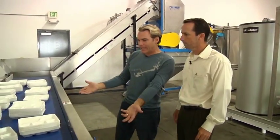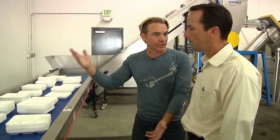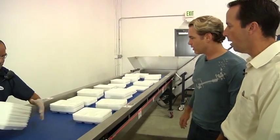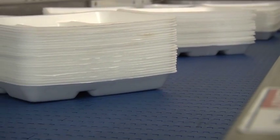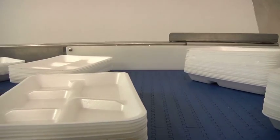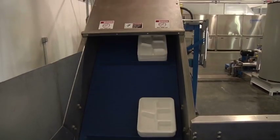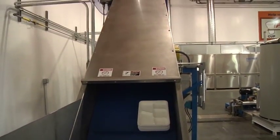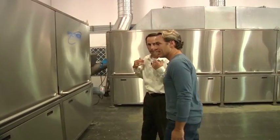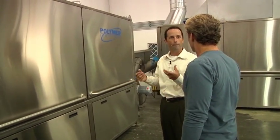So these trays — I'm looking at them, they actually look pretty clean, a lot like the ones up in Northern California. When you bang them on the trash can, most of the stuff will come off. These trays are being fed into the grinder right over here, so they're immediately going to be ground up. We haven't done anything to them at this point. We're going to grind them up into smaller pieces — that way they come unnested. It's just fluff, and then it goes into the washing unit. This is where they go from dirty trays to clean fluff.